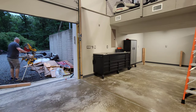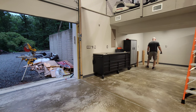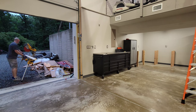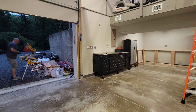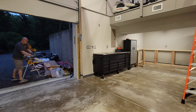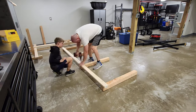This is the leftover material I had from the mezzanine posts — I used eight-footers up there and just cut them in half, so I had a little bit left over. I saved money, but they were probably more expensive back then than they are today. I'm just mocking them up in place. The only thing I really knew was my outside dimensions: that back post is 10 feet and then it came out about 60 or 68 inches toward the workbenches to make a nice L-shape.